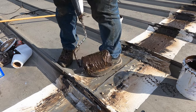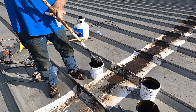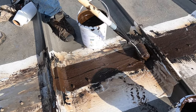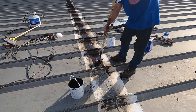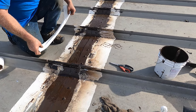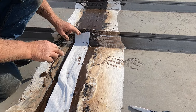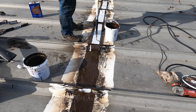I take my roller and pre-roll the Turbo Poly Seal over the screws and fasteners, about four inches wide. You have to apply it very thick and liberally — don't skimp on this. Then I put the fleece down over the seam, two inches on each side, right like that. Beautiful.